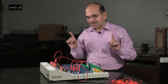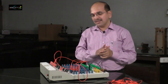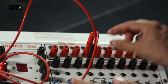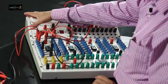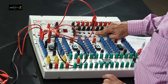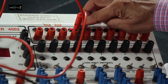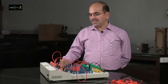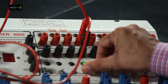The circuit is now ready. Switch on the power supply. The input is currently OFF and this LED is OFF. If I switch the input ON, the output will be LOW. If I switch it OFF, the output will be HIGH. This demonstrates the NOT action: if input is LOW, output is HIGH; if input is HIGH, output is LOW. This is how very easily you can convert a NAND gate into a NOT gate.